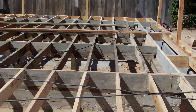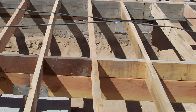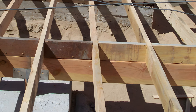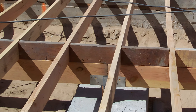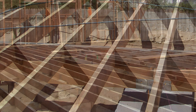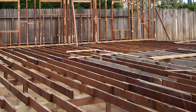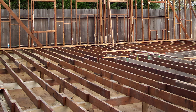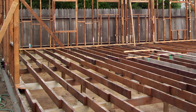Another thing you need to consider is just how badly damaged these boards are, and whether you'll even be able to add bridging or blocking in the first place. For those of you who have a slight bounce in the floor — and it is not sagging, the foundation isn't damaged, and you're not dealing with termites or moisture issues like wood fungus — then I would definitely try adding the blocks or bridging. Installing a row of blocks usually isn't going to cost a lot of money, and in my opinion you'll actually be strengthening the floor. So why not try it? And if it doesn't work, you're not going to be out very much money.